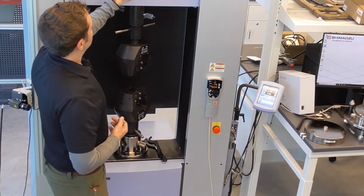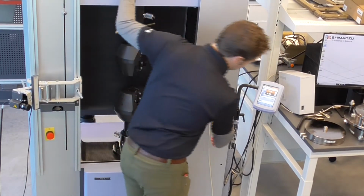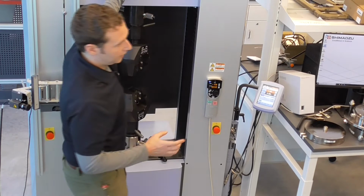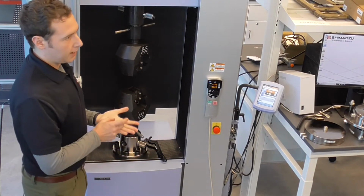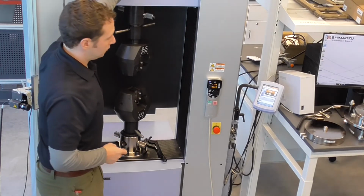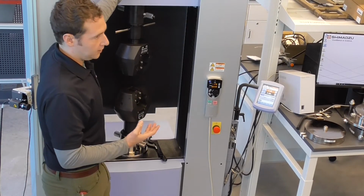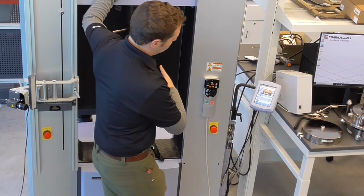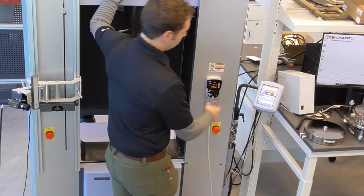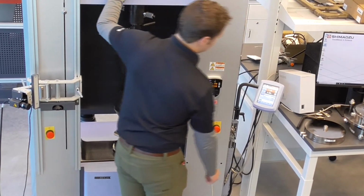So essentially, this load cell communicates to this frame via something called a cal cable. And the cal cable is this little guy right here. And inside that cal cable, as the name implies, contains all the calibration data with your load cell. So essentially there's little strain gauges, resistors in this load cell. As the load cell deforms, the resistance changes. When we calibrate the load cell, we associate that resistance change with a certain force. So all that data is contained in this cal cable.